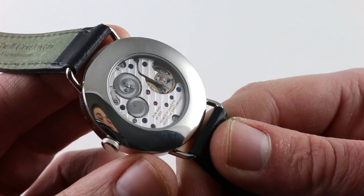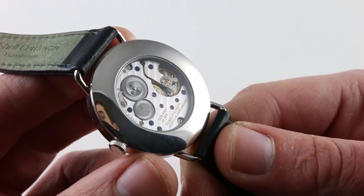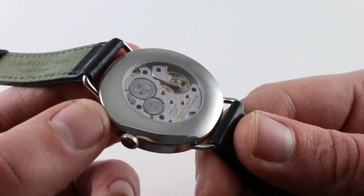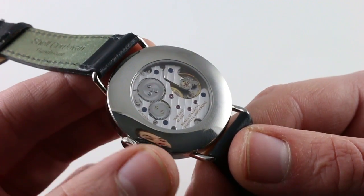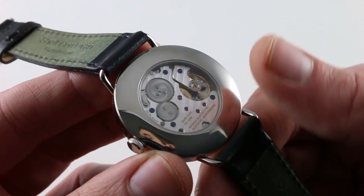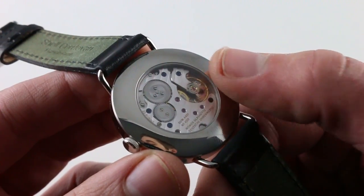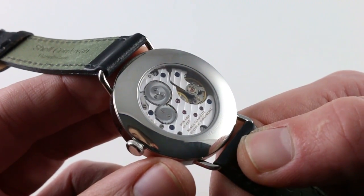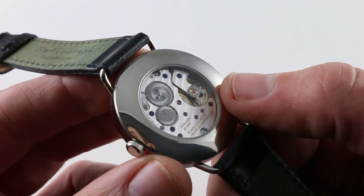The watch was actually designed in Berlin, as so many Nomos watches are, by a gentleman named Mark Braun, who is a noted industrial designer. And you can see on the case back, there's an attempt to bridge the gap between the size of the watch and the size of the caliber. Now, it is a Nomos DUW 4401, so it's Nomos' in-house caliber with Nomos' in-house hairspring and escapement combination known as the swing system. It's impressive to be able to make your own Swiss lever, and that's effectively what Nomos has done. It is not highly unconventional in architecture.